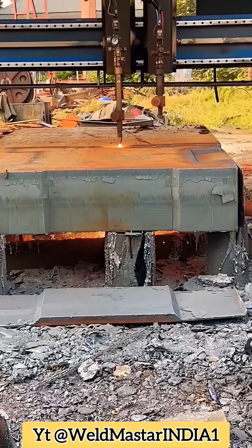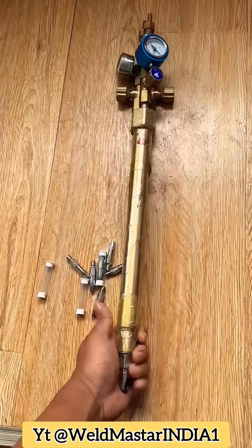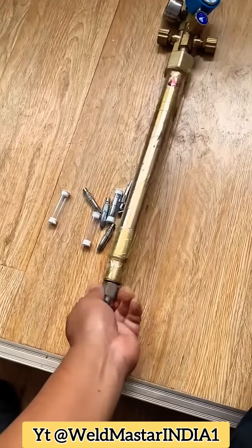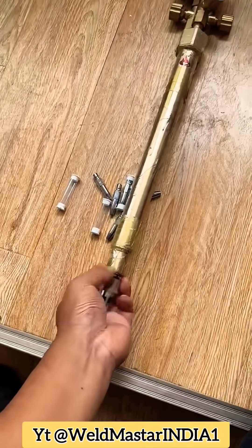This is our long barrel jet torch. You ask how long and why it's made so long — it has ribs. This torch really has ribs and the tip is a special type. The outer sleeve is very thick to protect the tip at high temperatures, so it's fine even when it gets hot. Because it's a jet-type torch, it doesn't erode the tip on backfires.